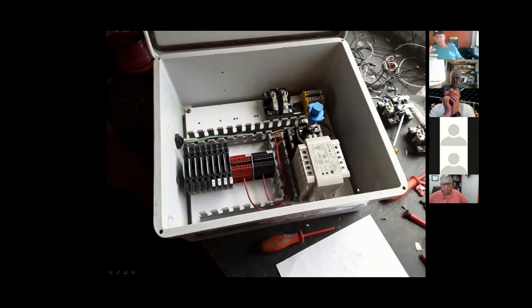Everything is worked from the back end of the trailer. The bales go in the back, and the material comes out the back. I think there are four motors on the unit, Len, is that correct? Yeah, four motors. And they're all controlled from that electrical unit, so you can shut anything down from that single location at any point in time. You can see the conduit there. All the wiring runs through conduit to all of the motors for protection.